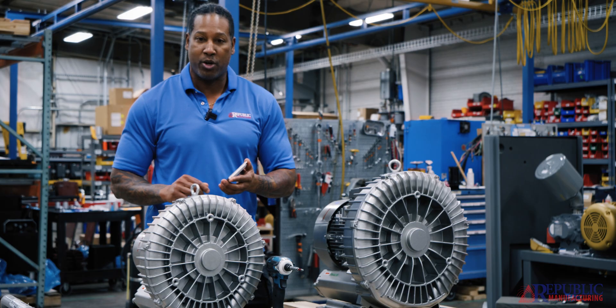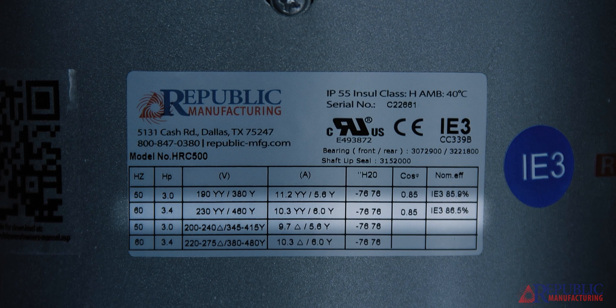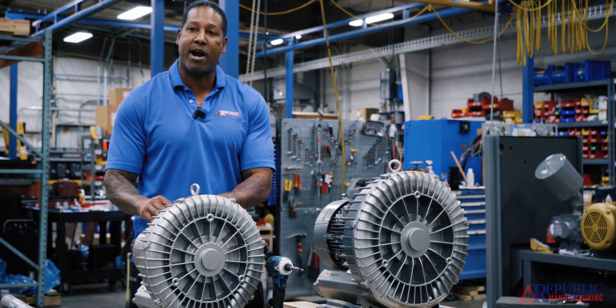On the smaller unit, we have the same wiring diagram, though if you look on the blower tag it tells you that this is for 230 volt as a YY connection. As a YY connection, I'm going to move my terminal bars as well as move my wires on the terminal block to configure to get to the YY connection.